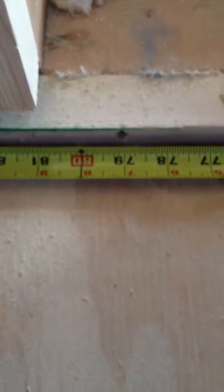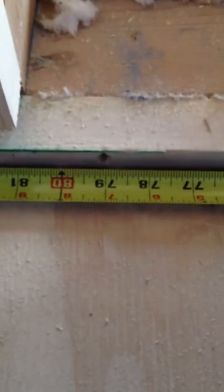With a 2-inch filler, 78 would be 80 inches. So we're right at that line here, which is just about where that stud is. So if we take the filler out a little bit and make it a little bit smaller, we need to come in at 81. We need to subtract. Let's make sure we're on the wall here. Okay, so at 81 inches, 78, we're at 80 inches with the cabinet.